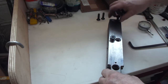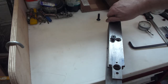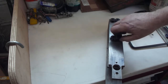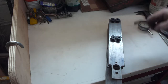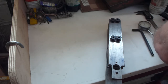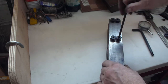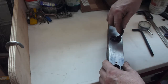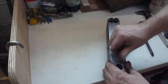And the top plate is drilled for 6 by 100. I was going on Tom Lipton's interesting ideas about making a double screw for the fine adjustment. He was using a quarter 26 and a quarter 28, so that the difference between the threads was only two TPI.